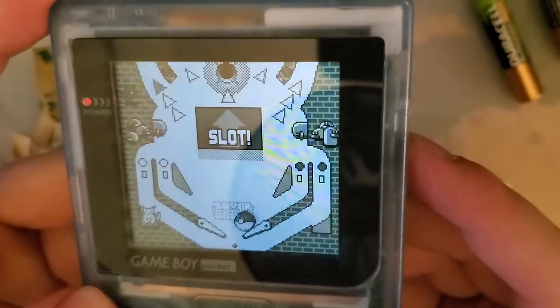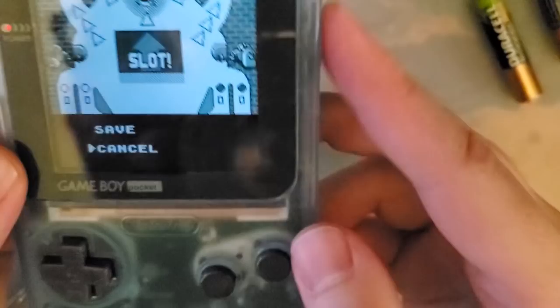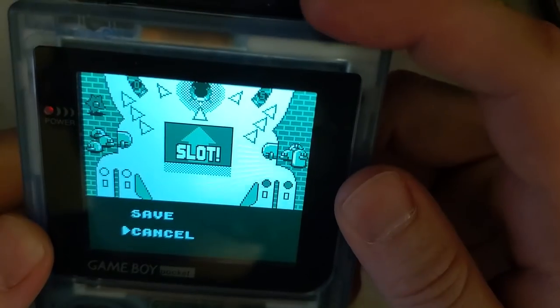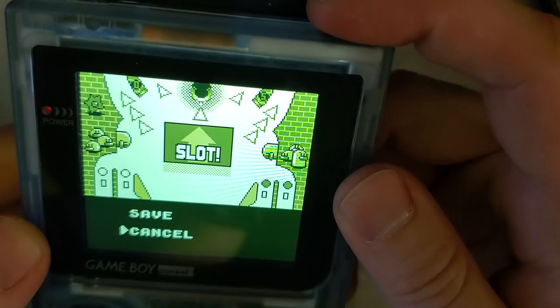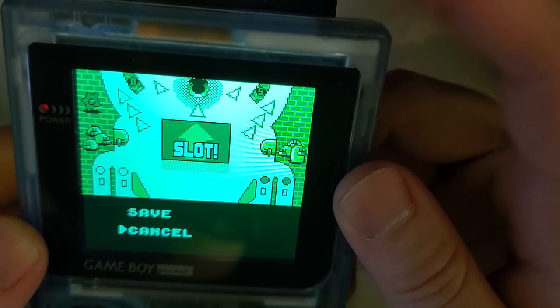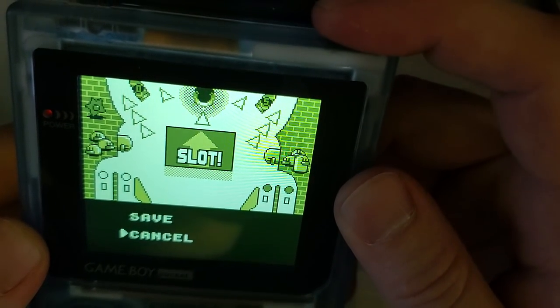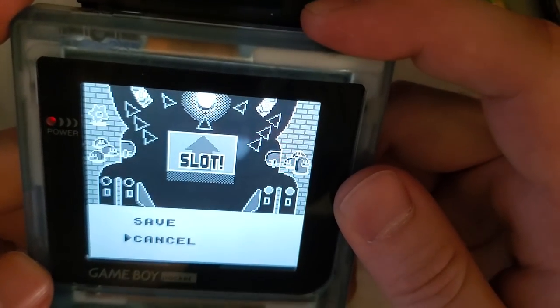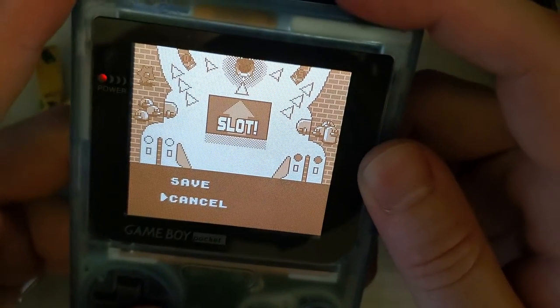I'm happy with that. I still have brightness control via the contrast dial. I still have my palette selection, I think. Yeah. Yep. Short press to advance. Medium press to go back. I wasn't doing that long enough. So, one Mississippi, two Mississippi. Yeah, 2 second press to go back, and then 4 second press to enable and disable the pixel grid.